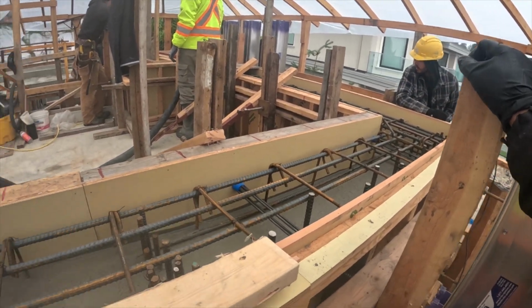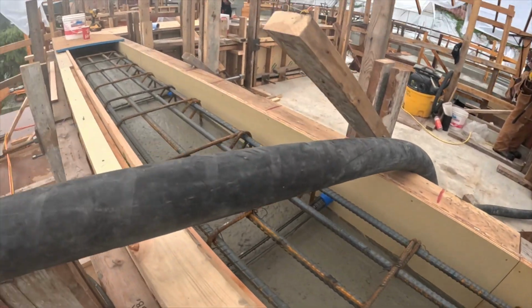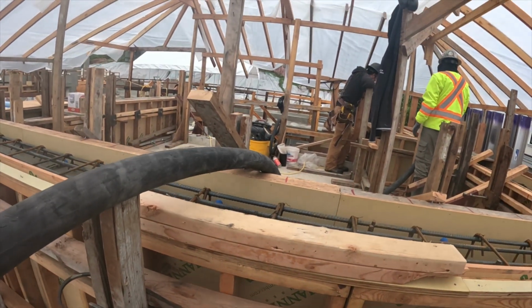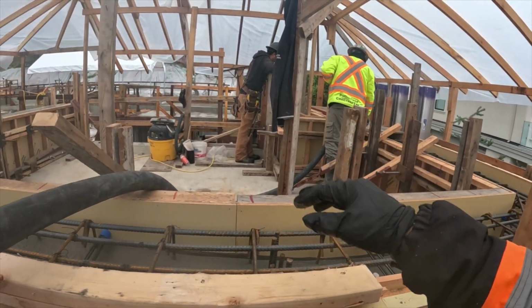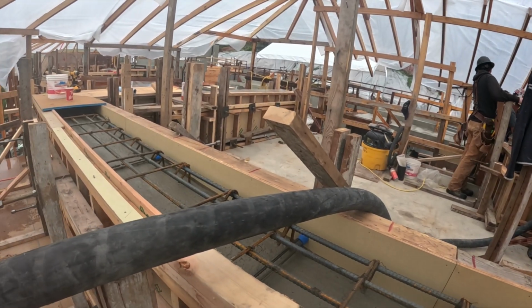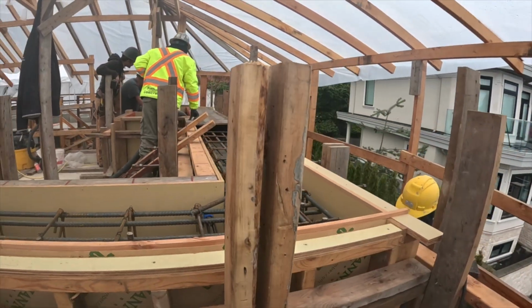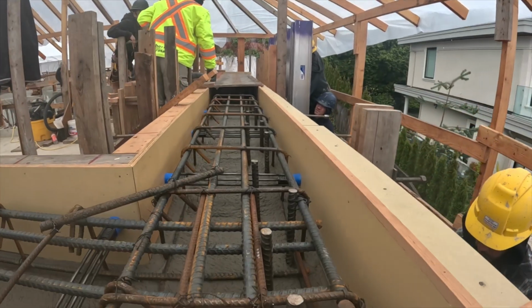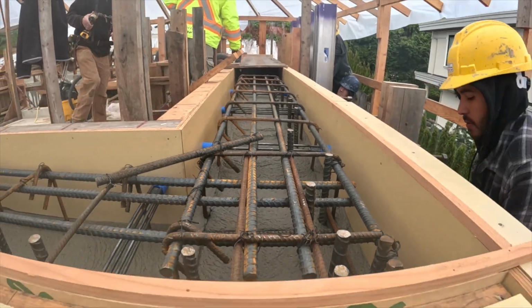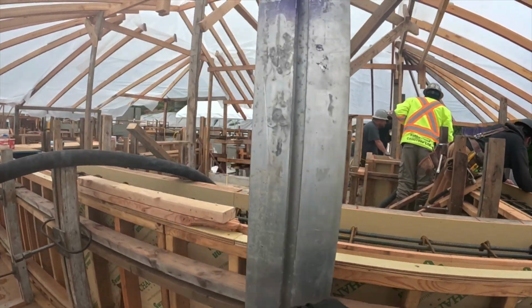That's also where the external vibrators help, to consolidate that together, the next pass or the previous pass. The stuff will come out perfect in terms of honeycomb and whatnot. There'll be nothing whatsoever. But the challenge is just avoiding pour lines, fly ash lines. It's definitely a unique type of concrete to work with, for sure. But so far so good. But this is where it's really going to slow down, as we have to cap all this off and bring it up to height. Ideally it wouldn't have any step downs or any slopes, but obviously it doesn't always work that way.